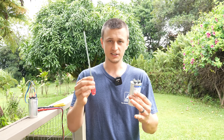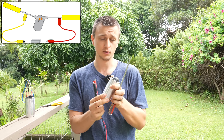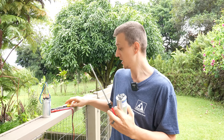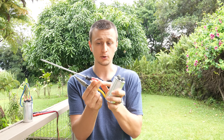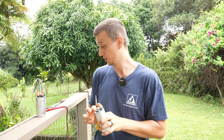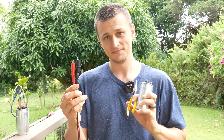The way I discharge a capacitor is simply by using a screwdriver. Some technicians will say that is not the technically correct way to discharge a capacitor — and they would be right. The right way would be to use a pair of jumper leads and a resistor. But personally, I have never used that method. I've always used either a screwdriver, a nut driver, or needle nose pliers. The only thing you have to make sure is that the handle is plastic or rubber, so fully insulated from the shaft. I think the resistor method is an unnecessary step. If you disagree, that's totally fine.